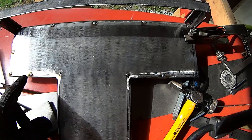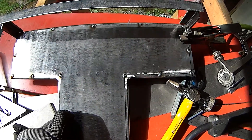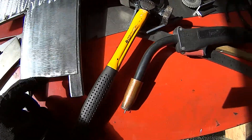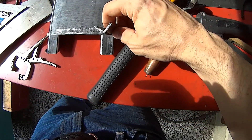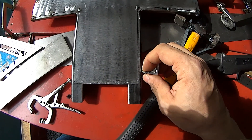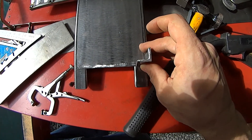This is costing me money in gas and materials and there's no reason to weld this thing all the way in — it's not going to benefit me. This is probably as much tacking as it needs. Before I tack down this corner though, I realized I forgot to notch this corner — I've got to notch it so this piece actually sits up in there, so I'm not obstructed when I go to put this piece on.